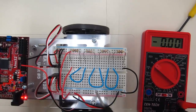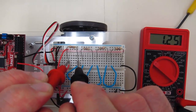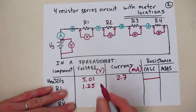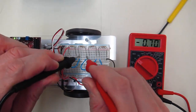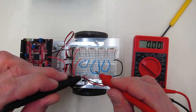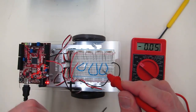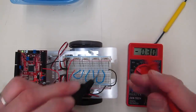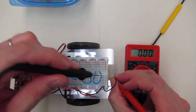If I switch the probes I can change the sign on that — I just arranged it incorrectly. So it's dropping 1.25 volts. That's the second measurement of voltage: 1.25. You need to continue this process. We'll measure the next voltage in this way, then measure the current in this loop, then measure the next voltage, and measure the current in this loop, and measure the final voltage, then open up the ground end and measure the current in that.